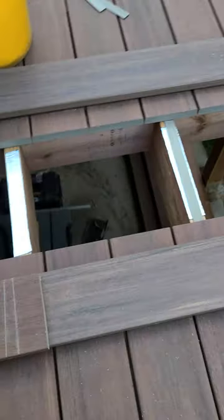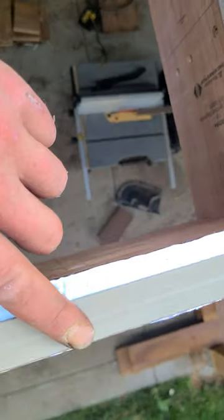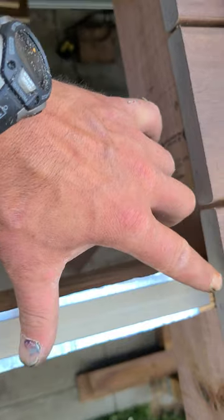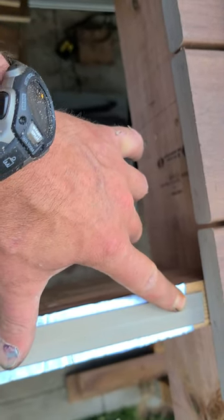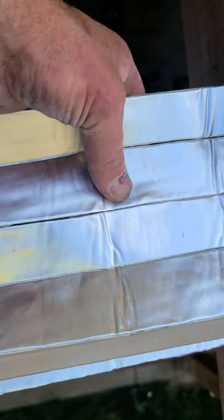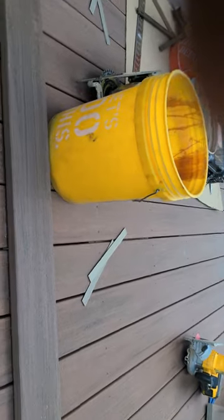Here's how I do that. Right here is where my picture frame is going. Step number one: I add a 3/64 shim where that picture frame is going — so less than a sixteenth of an inch. Then flashing tape goes over the top of that shim just to seal it in. That's the finished result right there.